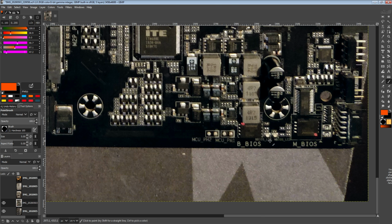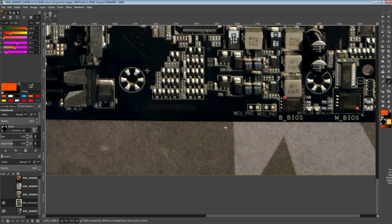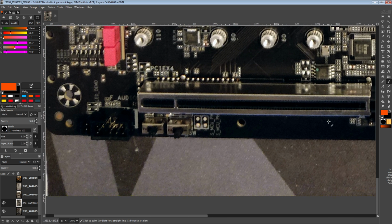But yeah, you need to have an indicator at the very least. Actually, the funny thing is there are dual BIOS Gigabyte boards which wouldn't give you an indication, but those are pretty old. Actually, wait a minute. I think the B550 Master might not indicate which BIOS it's on. So yeah, that's obnoxious, isn't it? But anyway, here you at least have indicators, because without them that gets pretty annoying.